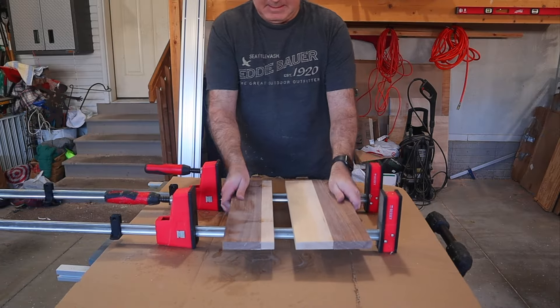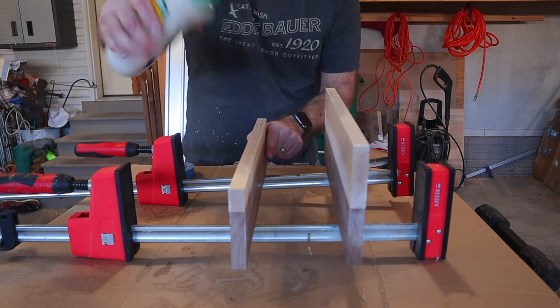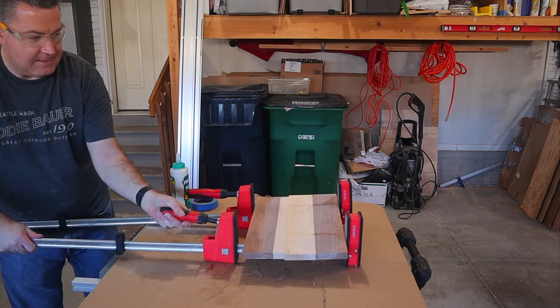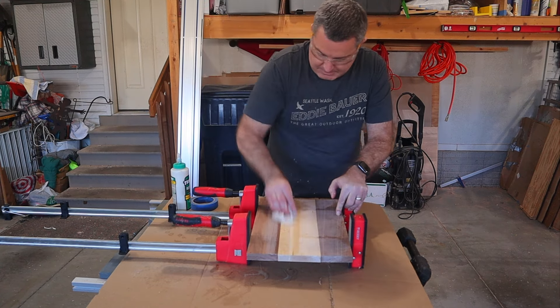In the end, I have one panel that is six inches wide that I cut a groove into, and one panel that is four inches wide to give me a final width of ten inches. Each panel has a three-inch strip of walnut on its outer edge, and when combined, they will give me a four-inch strip of maple that looks like one solid piece down the middle.